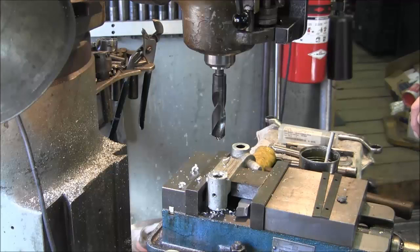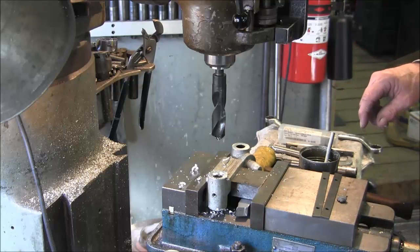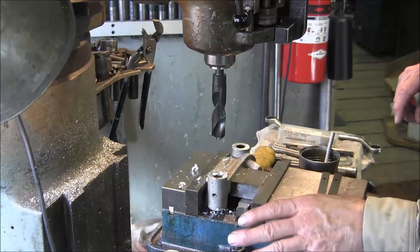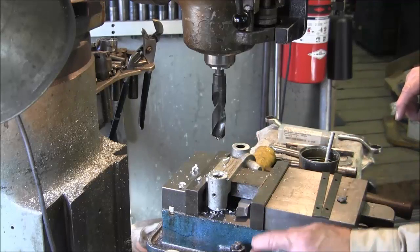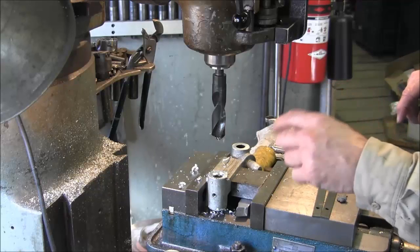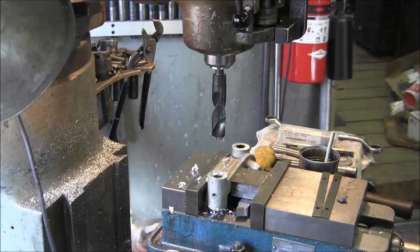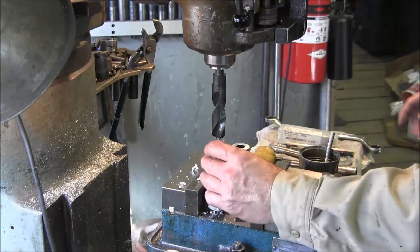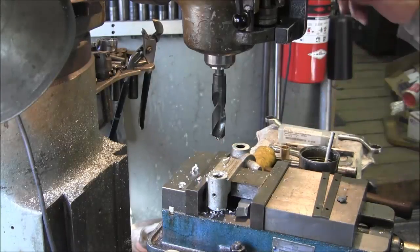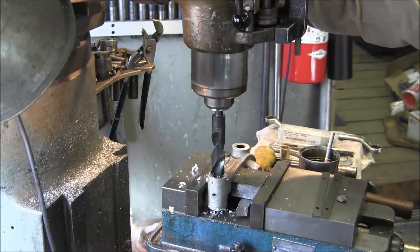We're just verifying the hole. It sure looks like a lot, you know, and that's because we didn't open these up like we did the others with that O-ring groove. So I'm going all the way from the 5/8 out to the starting of the 55/64s, to be just under for the 7/8 reamer that we have. I was just looking at that and I go, man, that is a lot. So I'm stopping right here where I could easily change out right now, but we're fine.